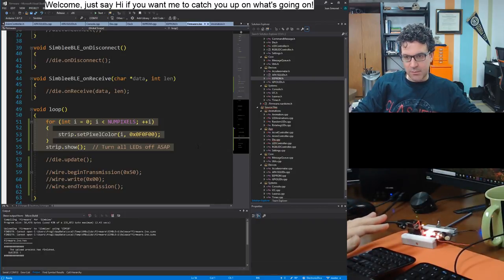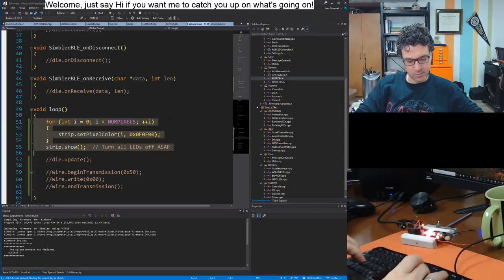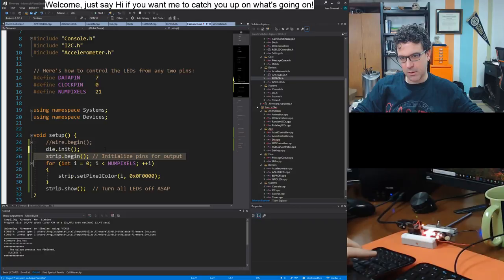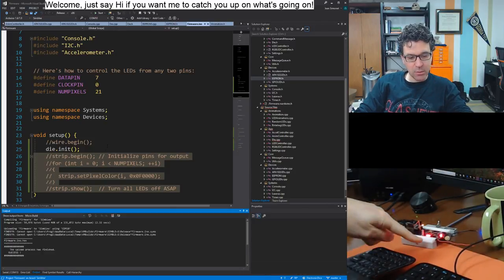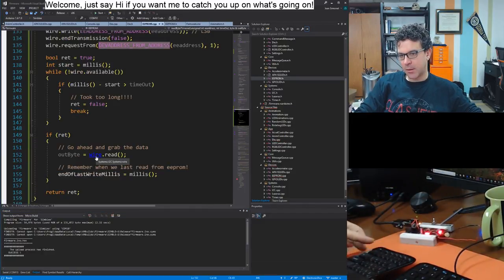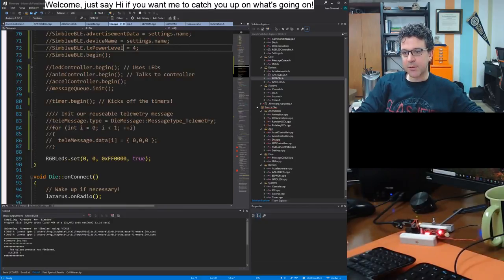For now, I'm going to pretend that everything is perfect. Oop, no. Comment this out. Leave this die init thing in properly. Comment this out, and upload. Success. Oh, and the one LED is actually something I wanted. If I look at die init, it does all the stuff, and at the very end it sets an LED.